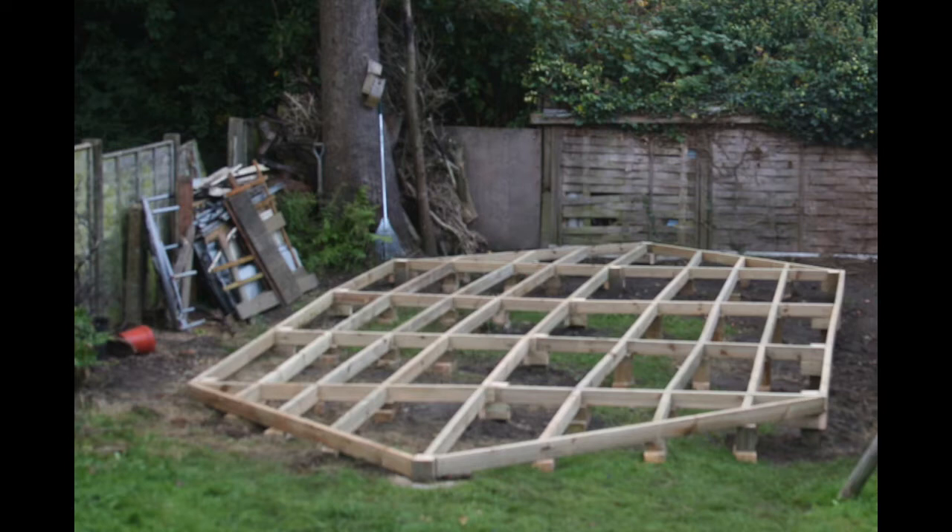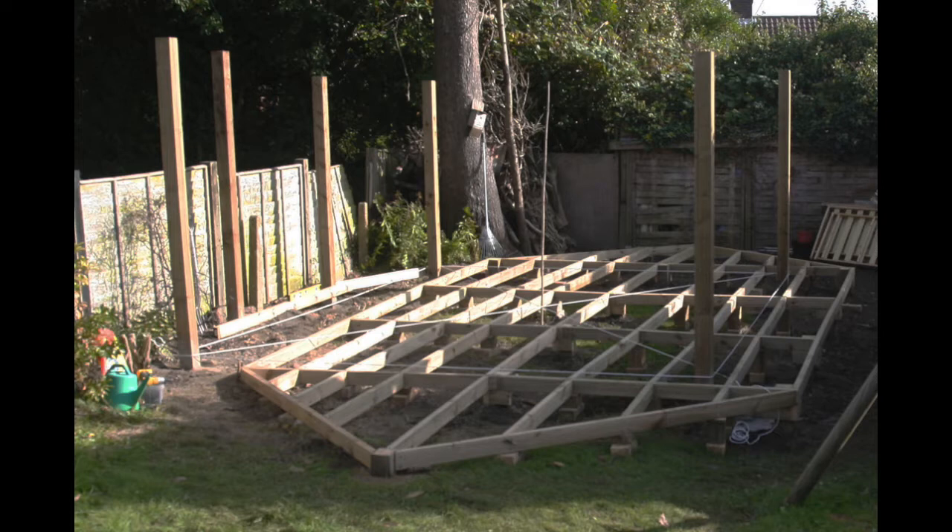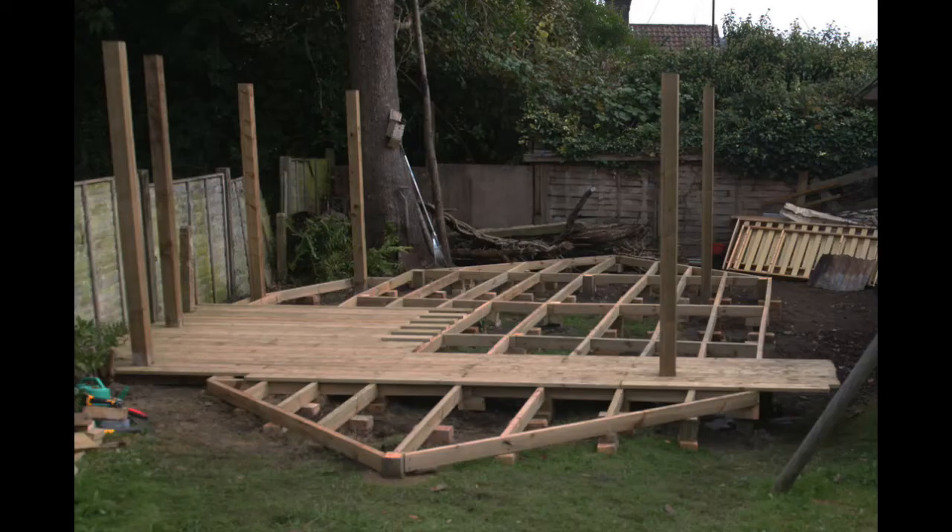All of this platform will be ultimately hidden underneath the decking that I'm going to put down. I then dug some more deep holes and filled them with postcrete, and these were to support the main uprights. Obviously these did need to be measured and put in very accurately. This photo shows how the main floor is not only resting on the original posts but it's also wedged up with lots of bricks underneath and screwed into the posts as well.